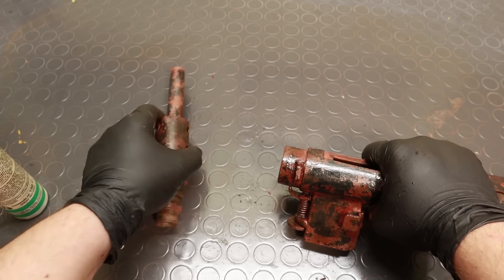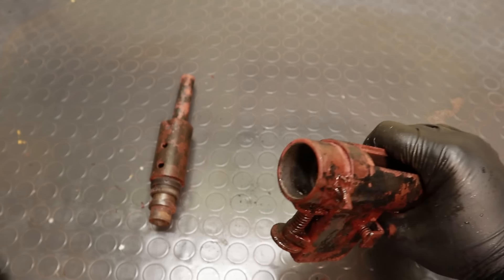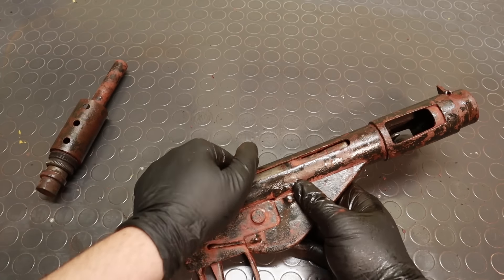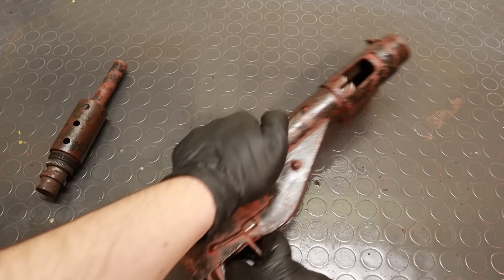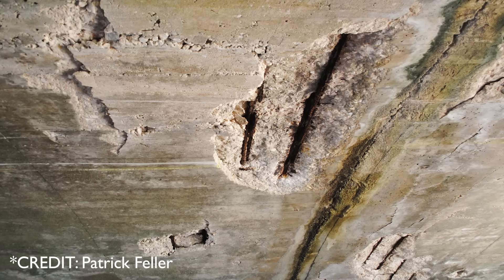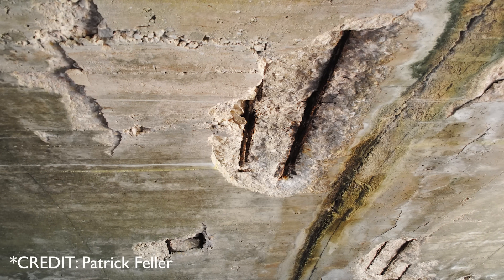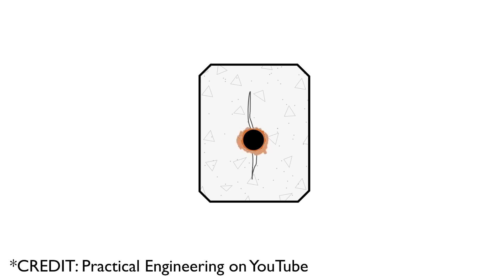The overall conditions didn't seem too bad. You're going to be surprised by how little metal gets eroded for a given amount of rust. That's because rust has a very low density compared to steel, so a small amount of metal expands to many times its original volume when it's converted to rust. As a curiosity, this increase in volume due to corrosion is what causes concrete spalling, because the rebar expands and breaks the concrete matrix from the inside.